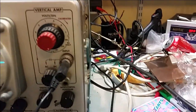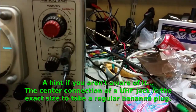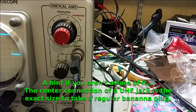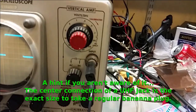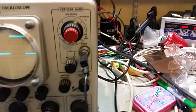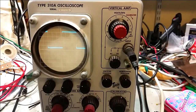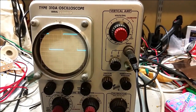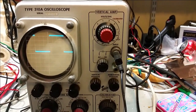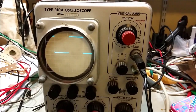The input is actually a UHF jack. What I'm planning to do is get an adapter — I've got a couple of them sitting around here actually — UHF to BNC, and then I'll probably get just a probe to dedicate to this scope and leave it attached, get it calibrated and tweaked for the scope, and just leave it connected.